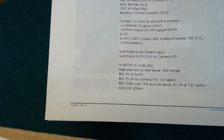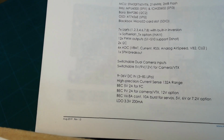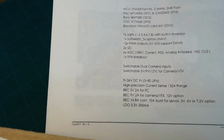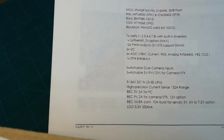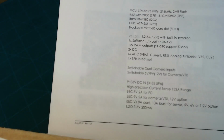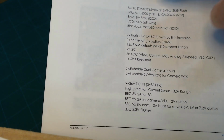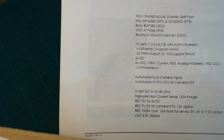So the flight controller firmware is utilizing that to write data to that memory card. And then if something happens after a flight, you can retrieve the memory card and stick it into a computer and load up some special software to interpret the data to see what happened. So all that's built into the board. That's not part of the microcontroller, but the microcontroller will have the firmware written to interact with all of these devices. So these are onboard devices.